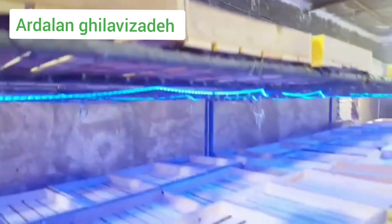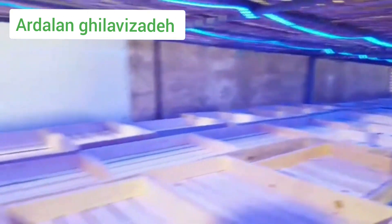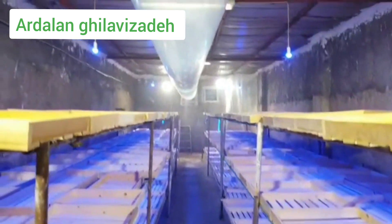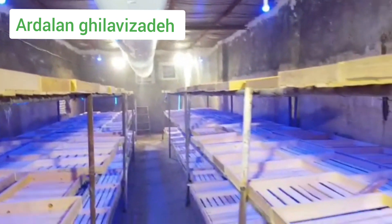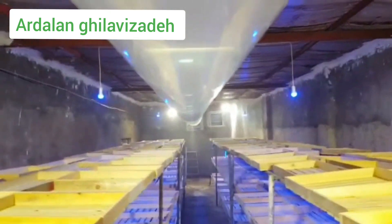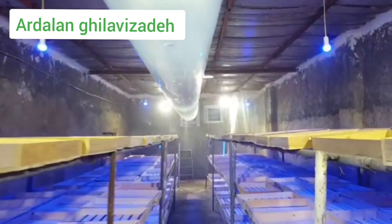We used a five-ton mini-chiller alongside an air handling unit and humidifier equipped with a coil. The mini-chiller cools water, which then enters the air handling unit's coil through outlet pipes, and cold air cools the building through plastic pipes. The air handling unit also provides the required humidity by spraying water inside the unit, and has dampers used to control carbon dioxide levels.